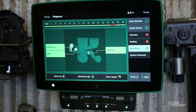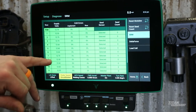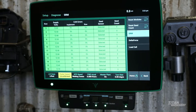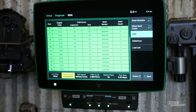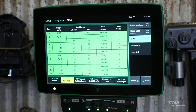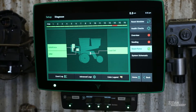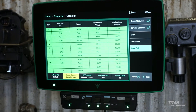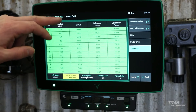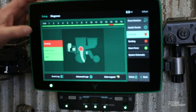We can dig into our SRM and look at our supply volts into each one of our SRMs throughout the planter — everything looks good there. Implement CAN errors — if there are any percentage of growing CAN errors on row units. Seed sensors you can see are all detected, seed count. We can look individually into the load cell readings per pound and active status for every row unit. And we can see we had an issue on our seating.